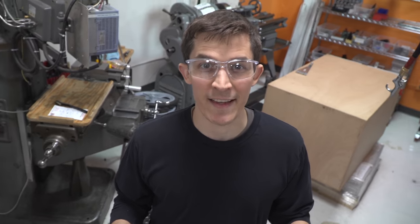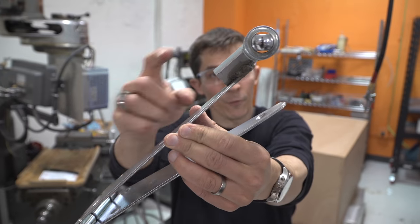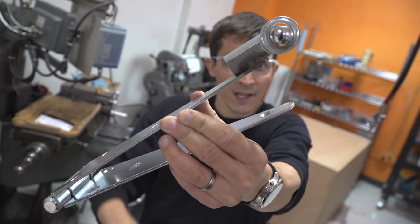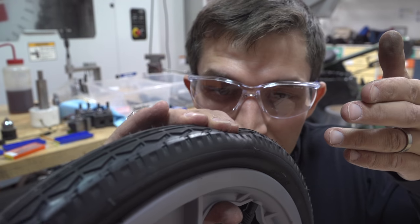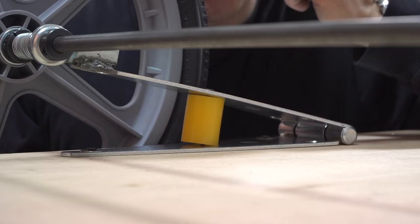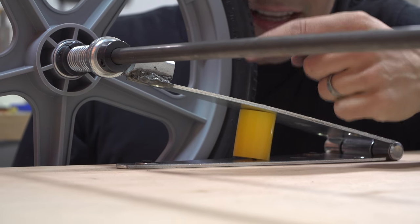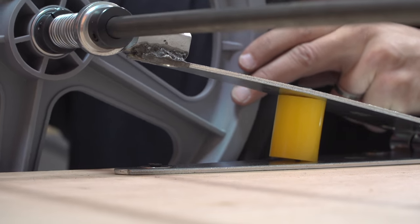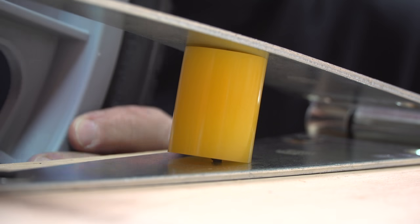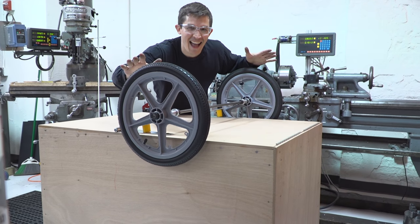On to the next stage. Now I'm building on the actual box, and I've got the rod ends welded onto the hinges so I'm ready to attach. There's some suspension in the tire that will absorb some of the bumps. The second place where suspension is happening is in the hinge itself — as long as we're only bending it a little bit, it'll spring back fully each time. Then the third place is in the elastomer. It works.